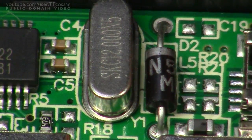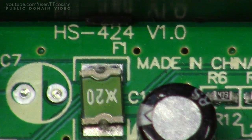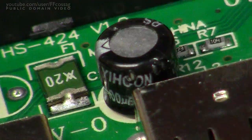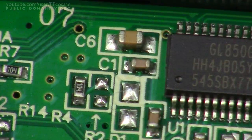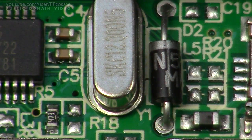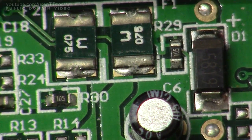What do we have? We have a 12 MHz crystal, a series diode for the external power feed, a 100 microfarad cap, and especially a polyfuse maybe. A bit dodgy on those two resistors, but yeah, it gets a pass. Doesn't look too bad honestly. For comparison, here's the top side of the board for the old one. We've pretty much got the same stuff except we've got two polyfuses there, a surface mount diode, and a 12 MHz crystal as well, plus another cap there.